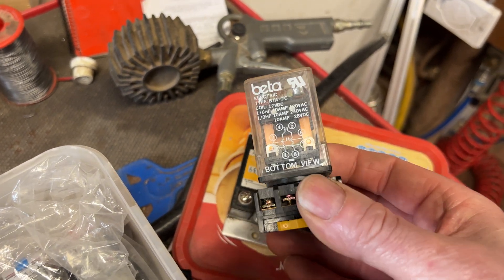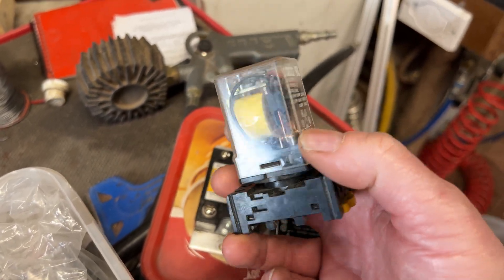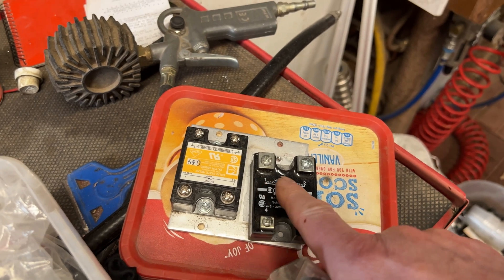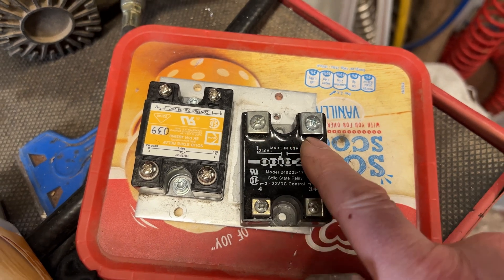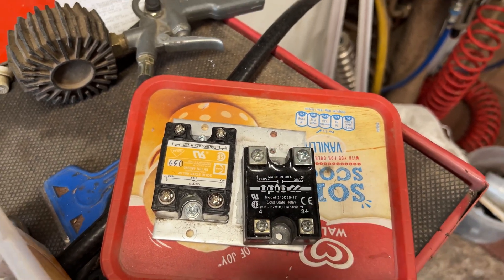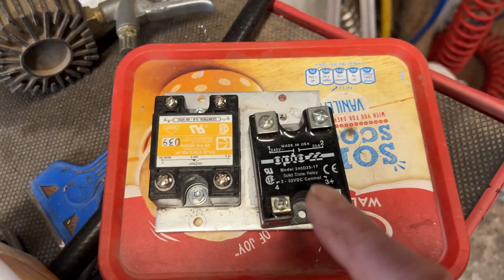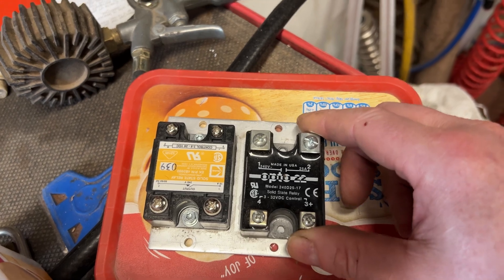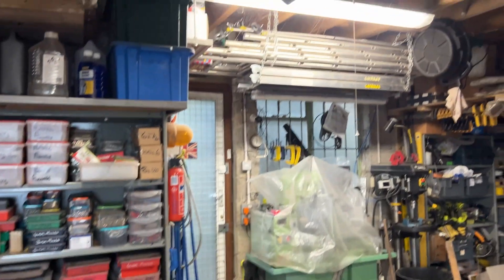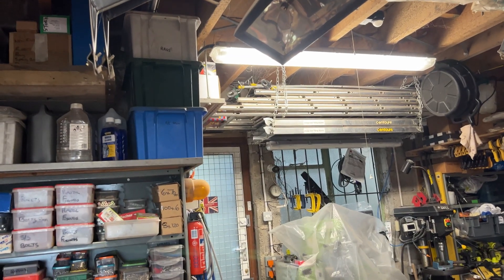This is the kind of thing it's been replacing. These mechanical relays are very handy at their uses of course, and some of these have multi-contacts, whereas a solid state relay doesn't - it's typically one pair of normally open circuits. So it's ideal for what I want it for, but wouldn't directly replace a mechanical relay unless you have multiple ones. I put one of them in three years ago, if not longer, and everything's been hunky-dory - the light switches on and off just as it should. But now I've swapped these out so the whole circuit is on low power LEDs.